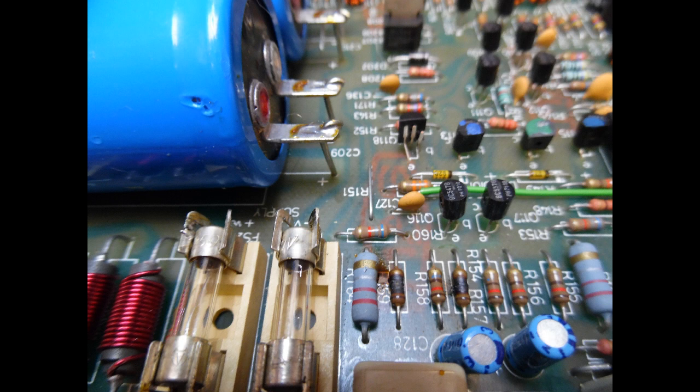The mixed signal is then routed to the left and right channel outputs, and the same applies for the tape monitor function. Overall it's nice construction — the main amplifier board screws directly onto the steel base plate providing a common ground, with a large toroidal transformer and large power supply electrolytic capacitors. The front fascia and rear are right-angled metal with slots cut out, held in position by fixing screws. From a service point of view, you just undo the grub screws on each metal knob on the front fascia and remove the fixing screws underneath.